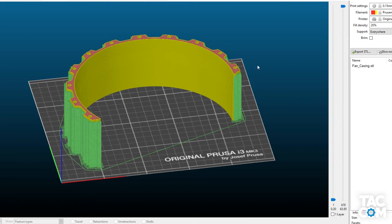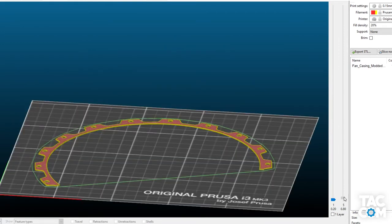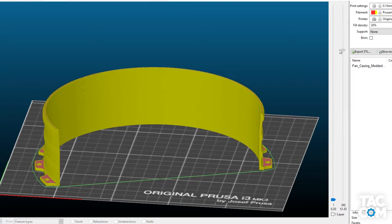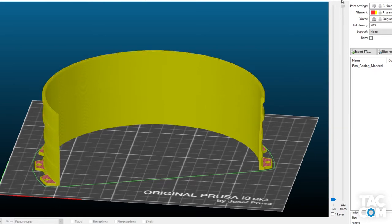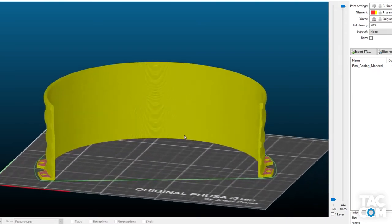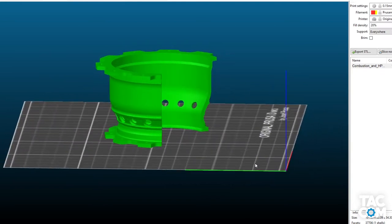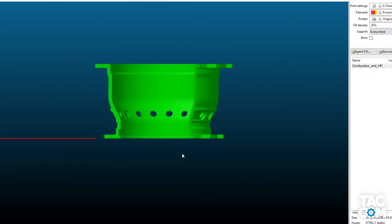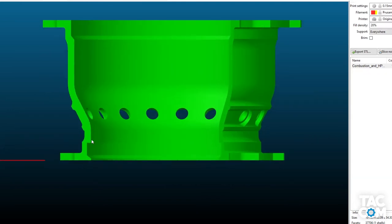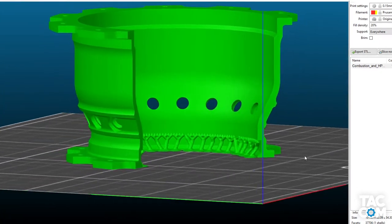Another issue is that a lot of support material can be wasted on the flanges. For some models, like this fan for example, you could simply remove an unnecessary flange at the top and have a much easier print. For the other ones, just make sure you orient the part in the correct way. Also, be sure to look for overhangs on the interior of each of the cases. The combustor case, for example, will need some supports for this flange here. I personally used tree supports for this overhang, but you can use whatever you want.